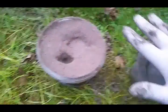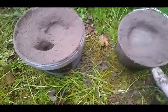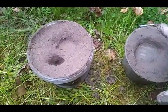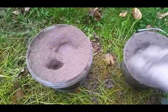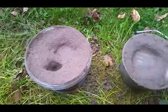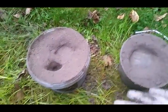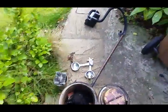I'm going to leave that for a few days to dry out, then do the final dry in the oven upside down, remove them from these plastic tubs — at which point the wax will melt out. It's usually best to do that just before you tip the aluminium, so the mold will still be hot and drier. If you've done it a week before and left it kicking around it will absorb more moisture and you'll get a bit more fizzing when you pour the aluminium in.